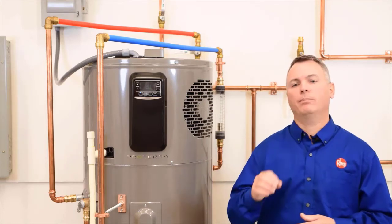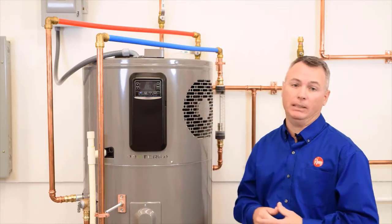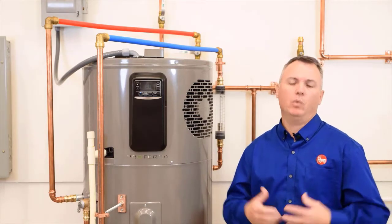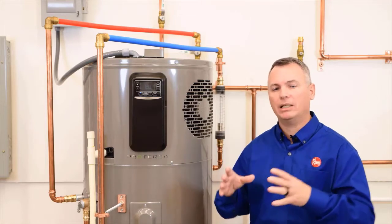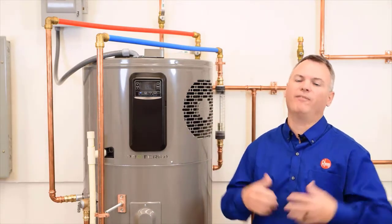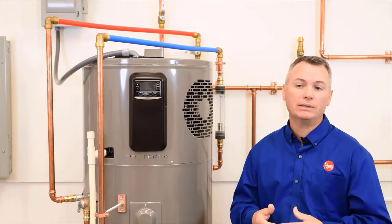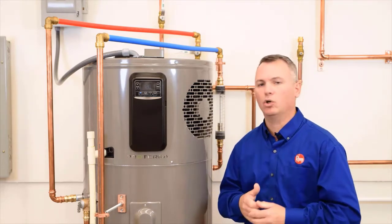The next recommendation when installing a water heater is flexible piping. The Rheem line of heat pump water heaters have the lowest decibel rating on the market, which means we've gone a long way towards making our heat pumps quiet and well insulated. But even still, we recommend installing flexible piping such as PEX on both the hot and the cold water lines to relieve the potential of noise caused by vibration when the compressor and the fan are running.